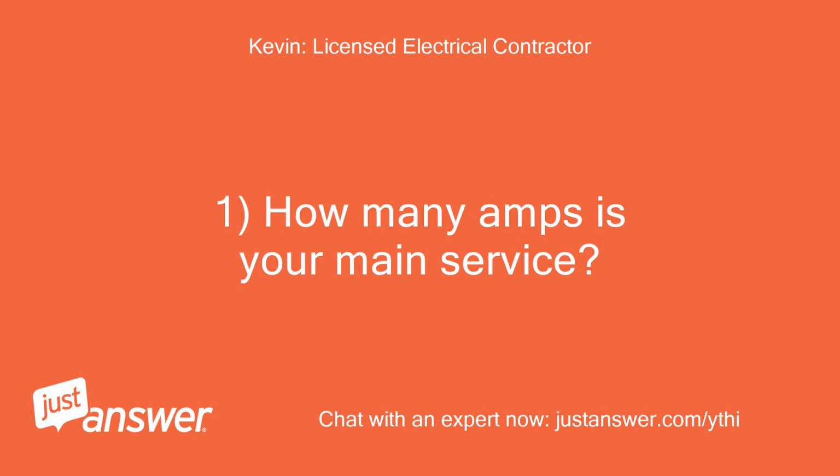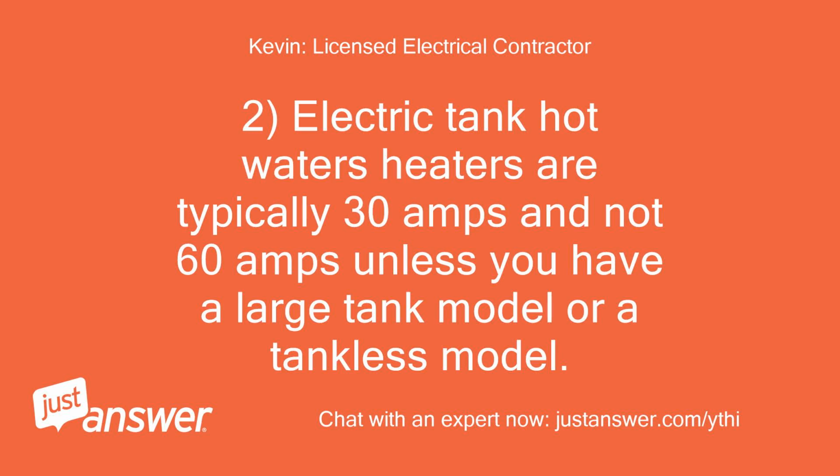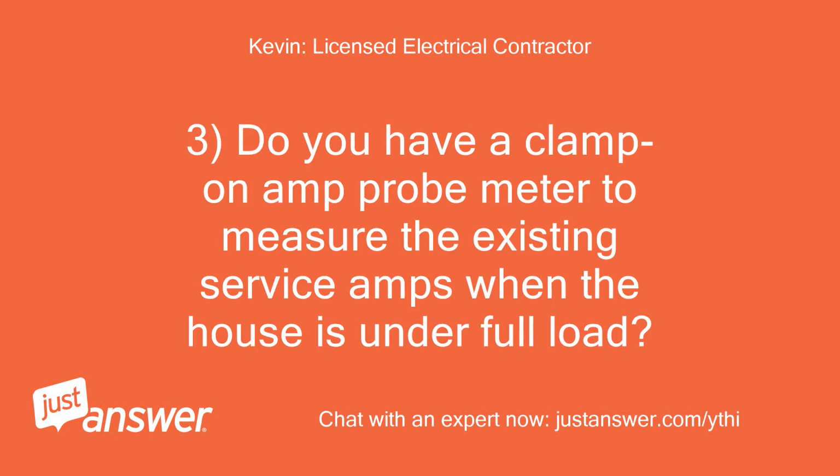1. How many amps is your main service? 2. Electric tank hot water heaters are typically 30 amps and not 60 amps unless you have a large tank model or a tankless model. 3. Do you have a clamp-on amp probe meter to measure the existing service amps when the house is under full load?